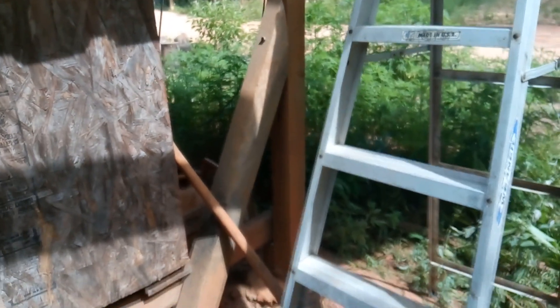It takes four bolts per solar panel. I've tested this for seven years and it's working out good — my system hasn't moved. I put 45-degree braces in to make sure the shear force from wind doesn't move it back or forth. It's handled up to 100 mile-an-hour winds, eleven and a half inches of snow, tons of storms, hail, and ice. It's holding out really well and not budging.